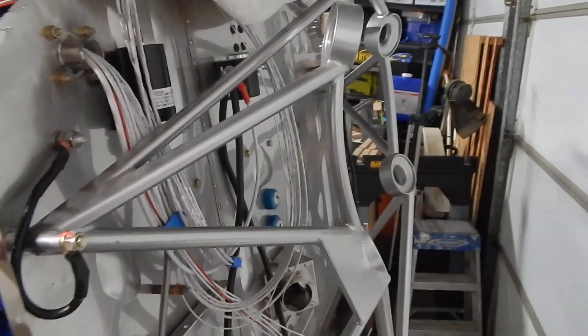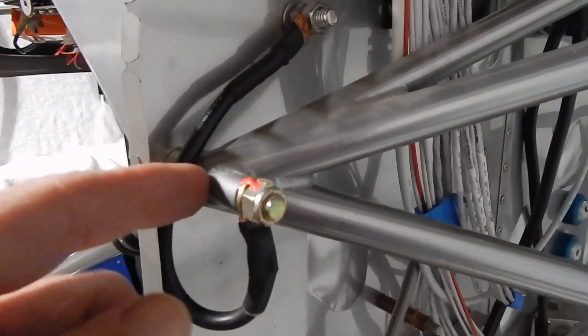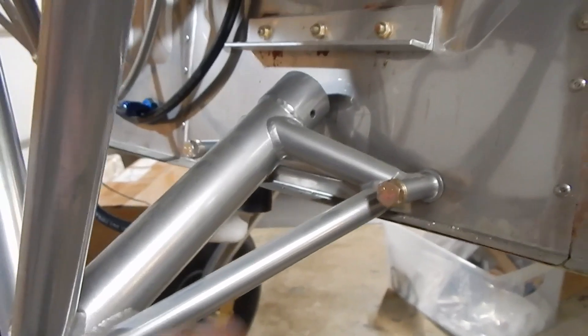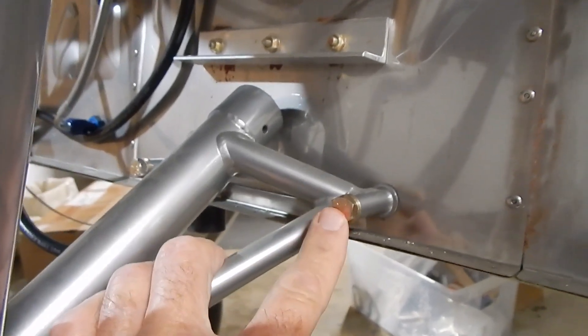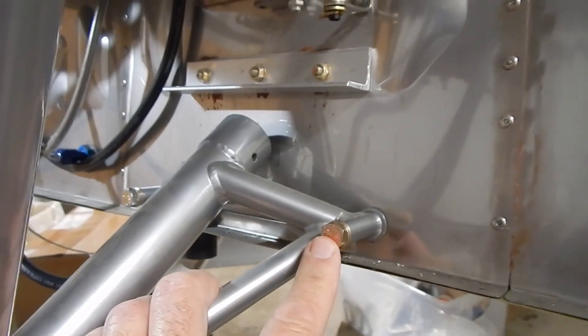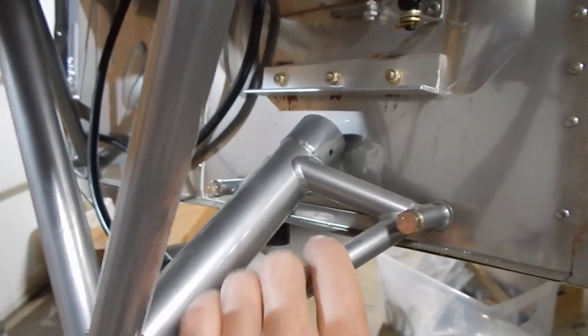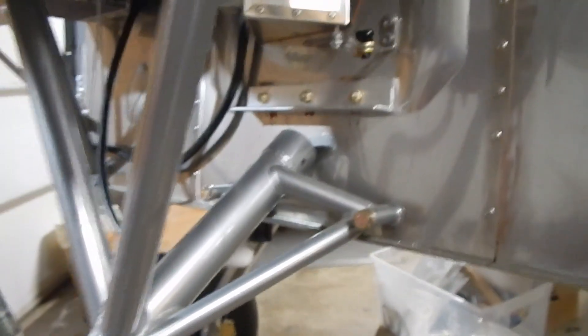After gathering just nuts, bolts, and washers, the engine mount went on fairly easily. You've got to work it a little bit and drill out the holes. I drilled out the 5/16 mount just a little bit to make sure I had a good ground. This is my ground bus wire that comes through the firewall from my ground bus. Everything is torqued down — it says between 100 and 140, I did 125. I've got the trike mount 5/16 bolts in. For the tail dragger mount, it's just the fourth position — if I ever need to add a nose wheel, or if a future buyer wants to, these mounts are in, giving the frame that much more support.